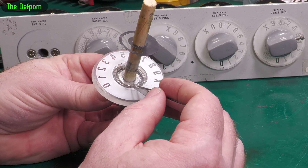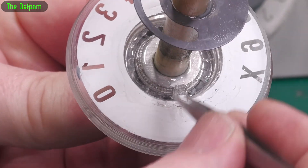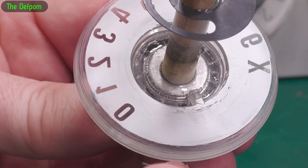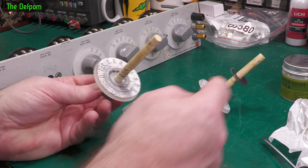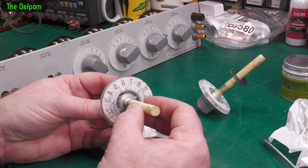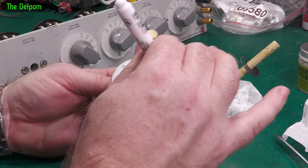I'm pretty sure it sits like this. Because the plastic is cracked in here, I think that's why the knob's coming loose. I'll put a whole bunch of glue inside there and hopefully it'll work its way in and make it all solid again. I removed the second one using the same technique. This one has that little washer missing, which is probably why it's worn — it's been rubbing on the front panel. That washer is supposed to stop it rubbing on the front panel. Now I'm just cleaning up this knob with a white paint pen to touch up where it's been scraped off.